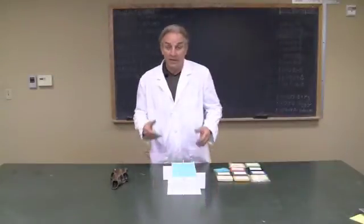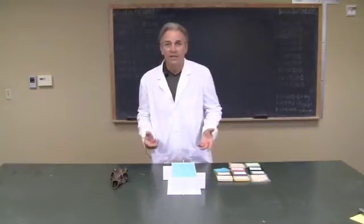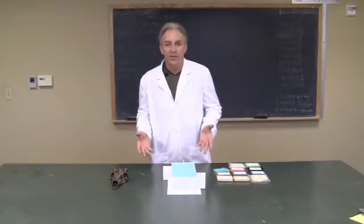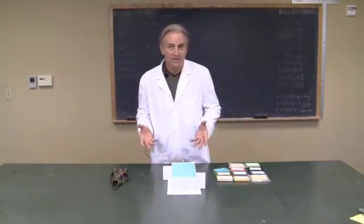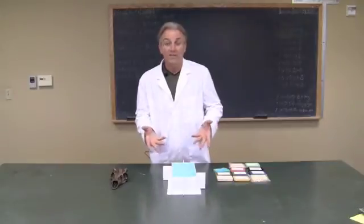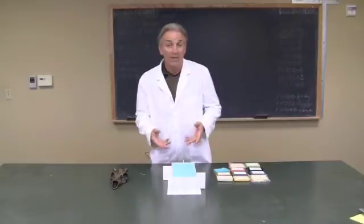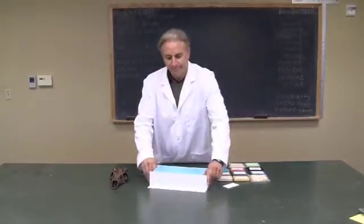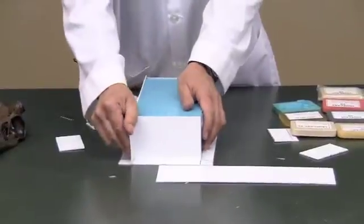It's been 24 hours and our mold has set up. Now it's time to take the mold out of the mold box. The mold box was made of styrene sheet — .080 styrene sheet — that was simply snapped and glued together with cyanoacrylic instant adhesive. We're going to destroy the mold box when we take it out. We're going to crack it out — it's a one-time use — and it comes out rather quickly. Just snap the edges off and it comes off fairly clean.